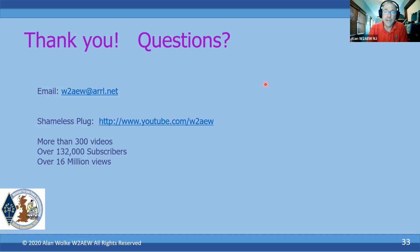But some of the other VNAs that are available, like from Array Solutions and things like that, there's a couple of other ones that are out there. I unfortunately don't have any experience with them to tell whether they're better or not. Most of them will likely do more than 101 points. They probably have got better dynamic range, certainly at the higher frequencies, because I don't know that they all use a simple square wave as the output, but it really comes down to what level of performance you need. So unfortunately, I can't give you a complete answer, Michael, because I don't have experience with some of the other instruments that are out there.